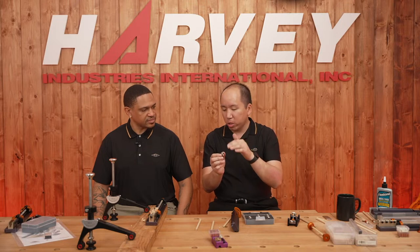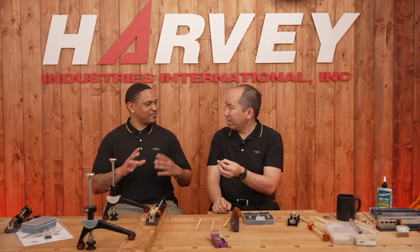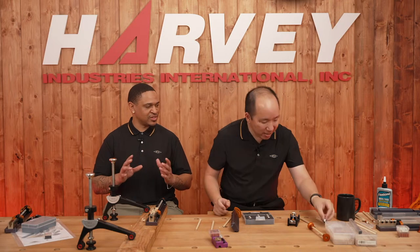Again, in this specific case, maybe a 5,000 to 8,000 grit. This is a die cutter, so it's very hard metal. And you just want to keep it honed, not sharpening where you're reprofiling or removing too much material. For people like me who may not know the 5,000, 8,000 grit, what is the reference to that?